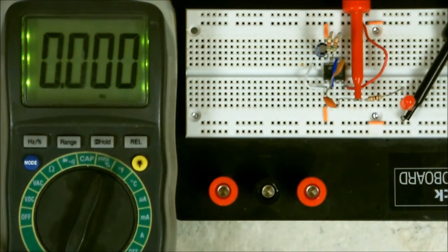Okay, here in this part, I'm going to show you about frequency, or hertz. Now, if you were to plug your test meter up to your power outlet, it will tell you the cycles per second that your alternating current, or your household current, is fluctuating, or how often it's changing polarities. Normally, here in the U.S., it changes right around 60 hertz. In most countries, it goes around 50 hertz.